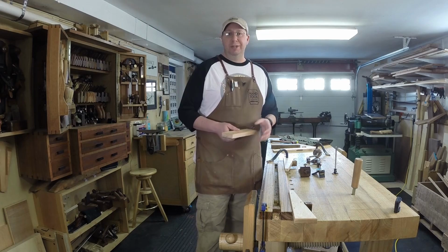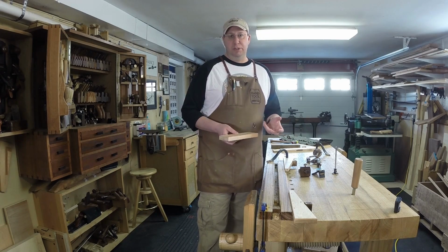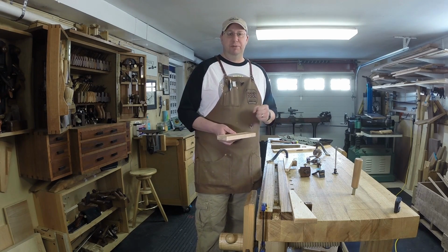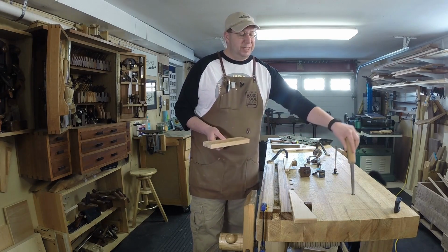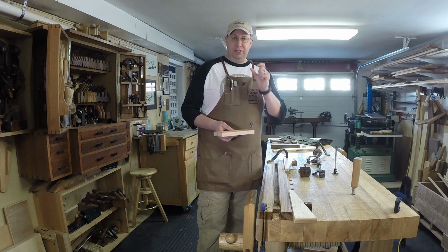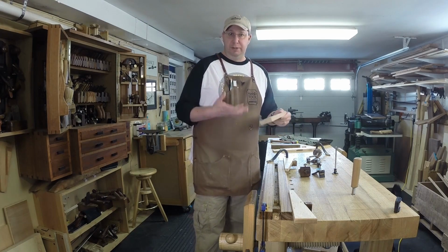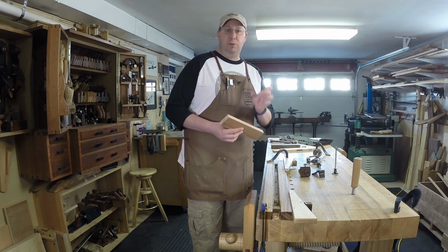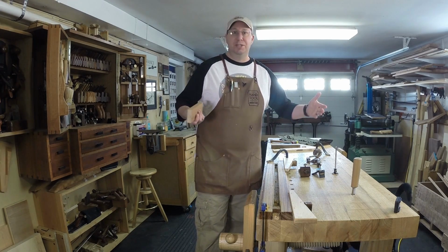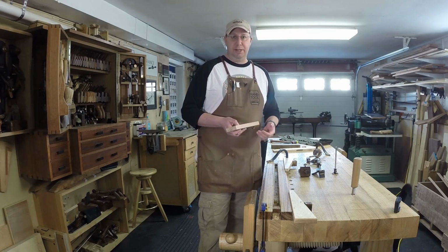C, and probably the most important, is if it's in a size that just doesn't make sense. I have 1/4 inch and 3/8 inch mortise chisels. I have one 1-inch mortise chisel that's meant for timber framing, and that is a really difficult thing to drive. Generally, when you get bigger than a 3/8 inch mortise chisel, you're starting to get diminishing returns. That huge amount of steel to try to chop into the wood just takes a lot of effort, can be really hard on the chisel steel, and can be hard on the wood itself. So more often than not, if you've got a mortise that needs to be wider than 3/8, or it needs to be 6 inches wide for timber framing, it just ends up being easier to bore it out and then pare it back to the lines.